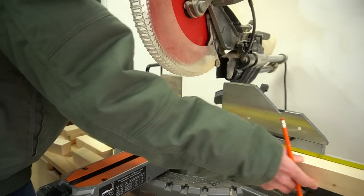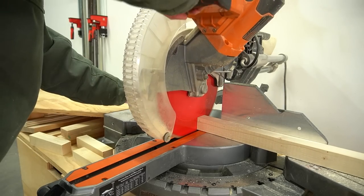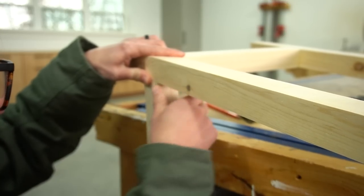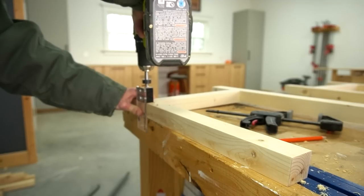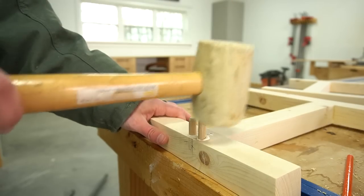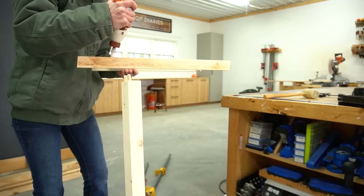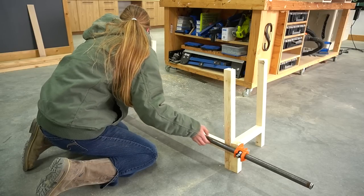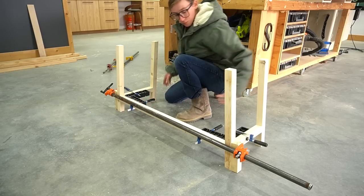Once the sides were dry, I cut one more 2x2 that will run between them along the back. This piece has five degree mitered ends to match the slanted legs. I needed a second set of hands here but just had to make do — I held the pieces in place and marked as best I could; that was the hardest part of this whole project. After the marks were made on each side, I drilled and assembled again using wood glue and dowels, clamped tight until dry. I used a long pipe clamp on the back edge with scrap blocks to protect the legs, and Rockler corner clamps to hold the sides square while the glue dried.